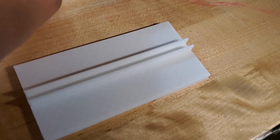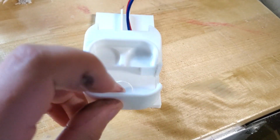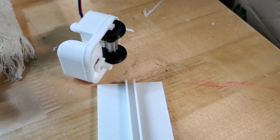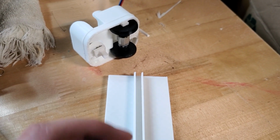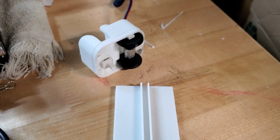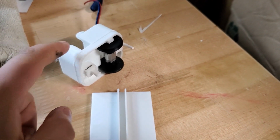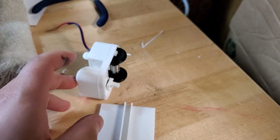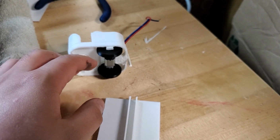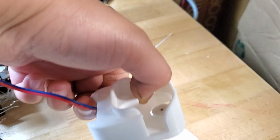so yeah, I'm not gonna put it on right now. So again, just to review, go over what I said. It'll just kind of coast on through, and it's not spinning pretty fast because the little actual motor is spinning really fast, but because it has the planetary gears on the side of it, it actually spins at maybe like 30 RPM. That's at 3 volts, and I want to say 50 when you put it at 5 volts. It's pretty linear, as far as I'm concerned, though I honestly didn't check. But yeah, so that's the Dark Red project.